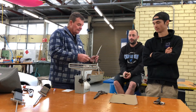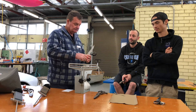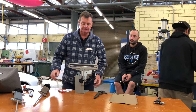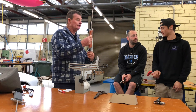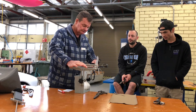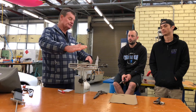Using the shear sharpener, I use a bit of permanent ink and run it along the set. That ink gives me the opportunity to identify the appropriate set for these shears. We have the coarse side of the stone and the smooth side, which is less coarse. With a brand new pair of shears you'd use the smooth side so you don't take too much metal off.